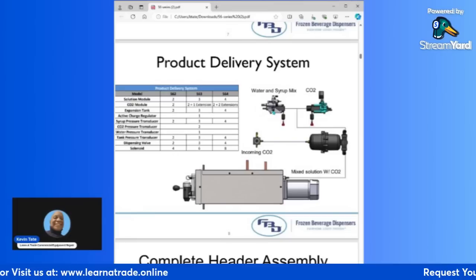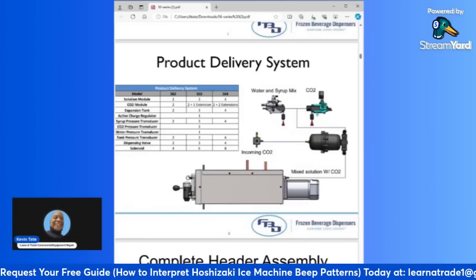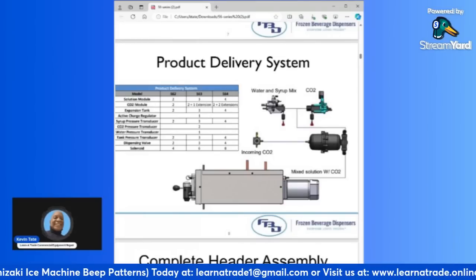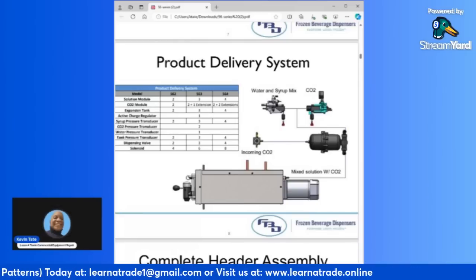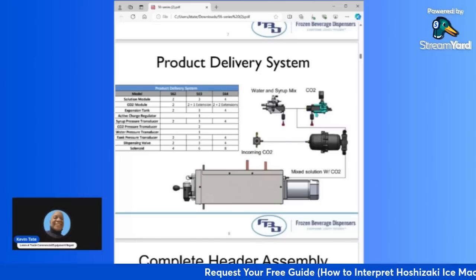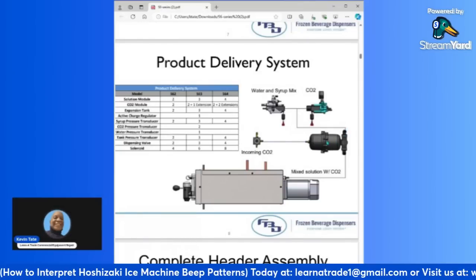This is the module where the water and the syrup are going to mix. This is interconnected with the CO2 module, which provides the CO2. And as you can see, it has a gauge on it, so you're able to adjust the CO2 to the proper pressure that's required right from this knob that's on the module. So these two are interconnected, and then they have a line that runs down to the expansion tank. This is your expansion tank.